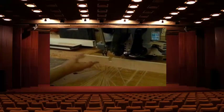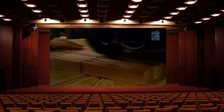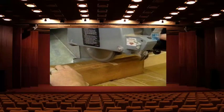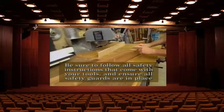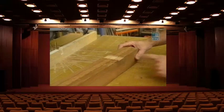These four end standards only get dado'd on one side. With a higher fence and the tool elevated higher above the table and new indicator marks, I've clamped the standards together on edge to make a notch for the horizontal pieces that'll hold the whole system together. Here's a group of three one-by-fours that are the center standards — I've made a notch on each side at the top area to receive a cleat that supports the display rack.